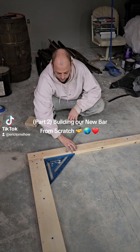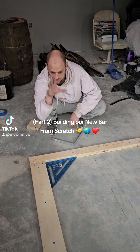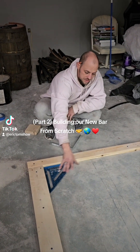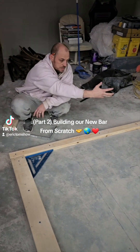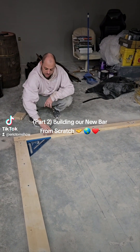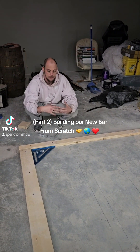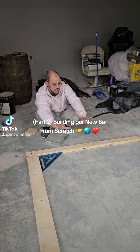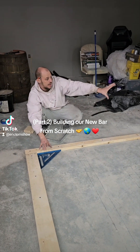Where these two intersect, there's a difference. We needed this two-by-four over here. Once this pony wall gets built, we're going to jump off that with a secondary wall out this way to give them storage on this side. It had to be a two-by-four framework because two-by-six plus an additional two-by-six — the depth we needed in the cabinet — all that played a role in how far out we can come because of the other cabinetry, the sink, and all that going in here.